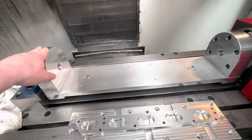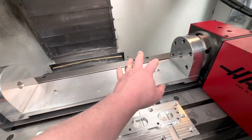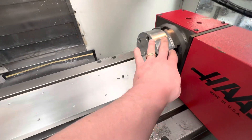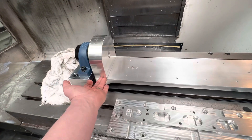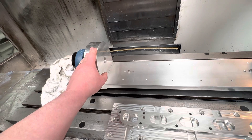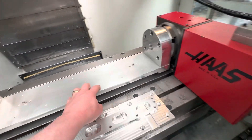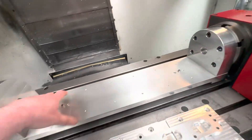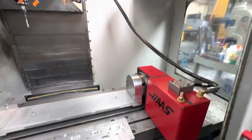Because I want to be able to take this off and put it back on, I'll probably stick with these for this piece and only use these going forward. In future I'll remake them in steel, from ground stock, to make sure they're nice and true. But I want to be able to use this plate for various jobs, so now that it's aligned and we've got our dowel pins in location whilst it was all bolted together and true.